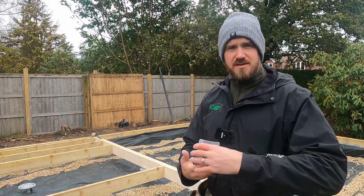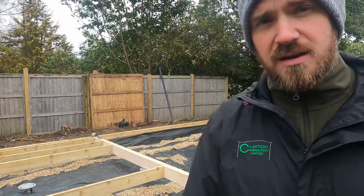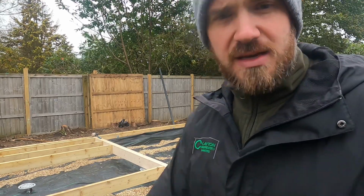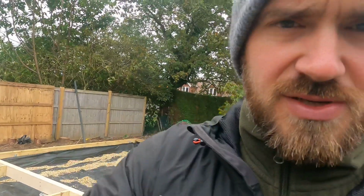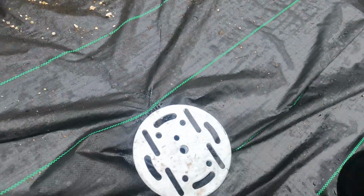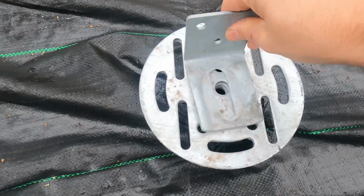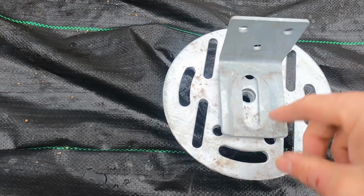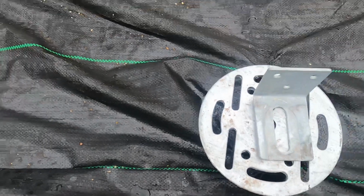So guys, like I was saying in the previous section of the video, I've got these connecting plates here which mount onto the screw. If I take you down to one of the screws, I'll show you how they mount on. Excuse the knees, they can sit anywhere on the plate. They can even sit in the centre as long as you've got a 12mm threaded bar with a nut on it, and you've got all this adjustability to be able to manoeuvre it.